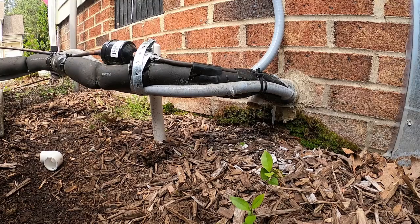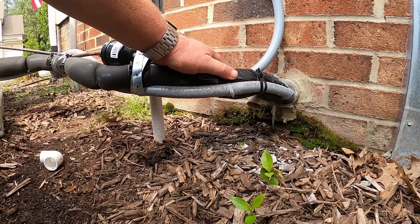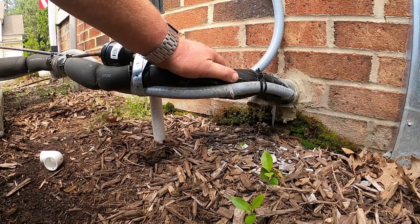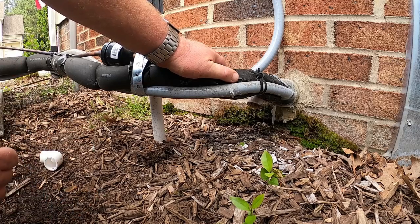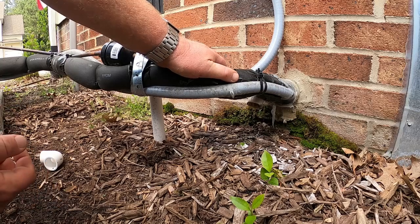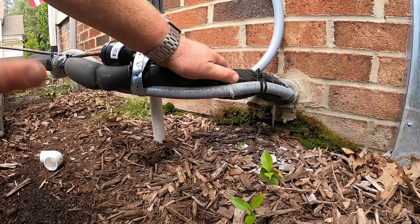Drain line video — now I need to do a capacitor video and I'll be good to go. Still got pan full of water upstairs. It's a small pan under an upflow. I filled water into the drain, it backed up to the trap back there and started bobbing, so I knew my drain clog was going to be somewhere. This has three 90s between there and here, going down the wall, coming under the house, then does another 90 and comes through here. So let's go up in the attic and get that pan clear, make sure we can get all that water out of the attic.